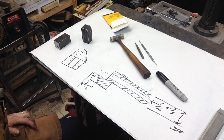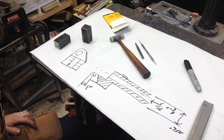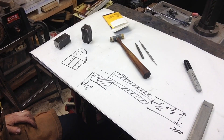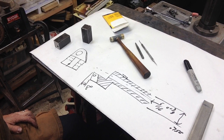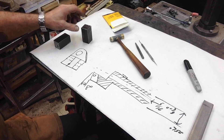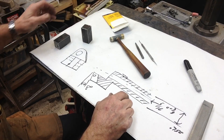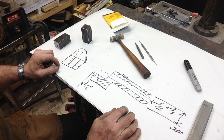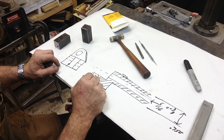These turret tools are mostly based off of plans from Downriver Tools — I bought several sets of prints several years ago. I've done a couple of them, including some self-releasing tap holders. I modify all their plans just a little bit; the geometry is the main thing I've gotten from those plans. Their original drawings are designed for half-inch and five-eighth shank tooling, where all of my stuff is three-quarters. We've got an eight-degree bevel for our cutting — I believe that's a tangential cut, easier to sharpen your tooling.